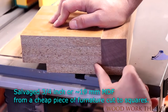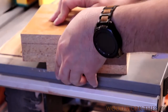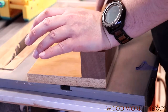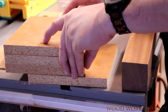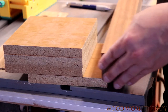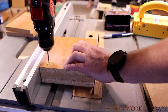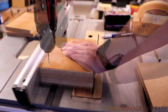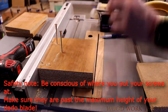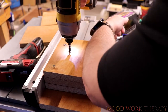The first part of this project, you want to go ahead and throw together some scrap MDF and make sure that it measures up with the depth of the object that you're going to be cutting into, generally a square board like the one we have here. Just put a marking line for reference, then line up your MDF strips to that line and make sure everything fits correctly. Once that happens, go ahead and drill through the MDF — even with some good bits, this does take a bit of time. Just make sure the holes are high enough so your screws won't impact the dado blade, and then put in your screws with an impact driver, because this stuff is pretty hard to go through.